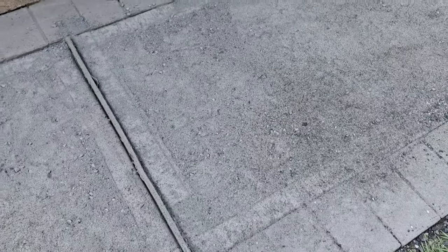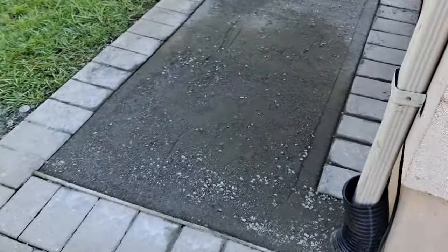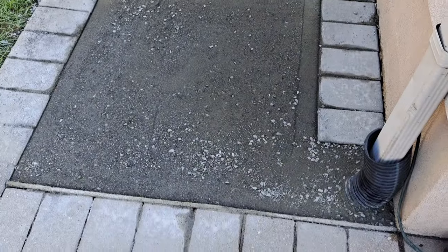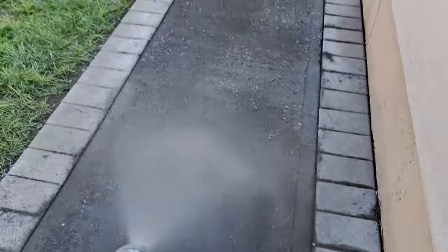You can see the color changes as we start misting the concrete — just make sure it all turns a dark gray. All that residue and rocks on the outside bricks will stain and stay there forever. As you can see, mine currently has white bricks on the outside — they used to be red, but now they're white. Again, it was a temporary thing, so I didn't care. I was running out of time and just had to get it done. For rushing, it really wasn't that bad. Here's the second misting — this is the second application, one hour after the first.